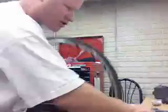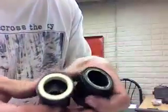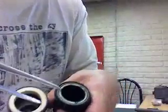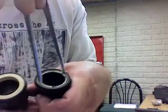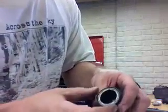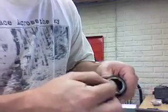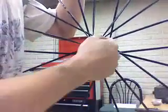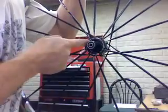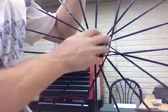What wears down is that nylon bushing — you can see how it's really gunked up. Here's a new one for comparison. What actually wears is the thickness right here, so the inside diameter increases with wear. What wears the nylon bushing down is debris and contaminants that get in there — they're very abrasive and grind away the bushing. If it gets really bad, it will actually decrease the outside diameter of the nose part that the bushing rides on. It's not a bad design — it's just something that has to be maintained.